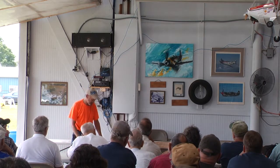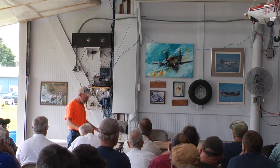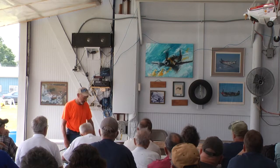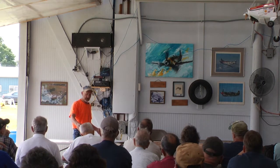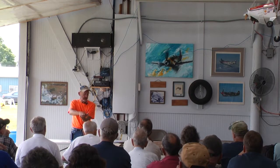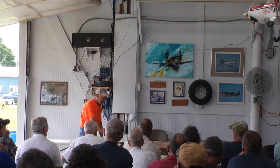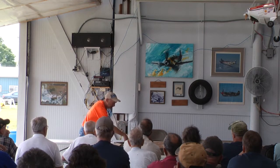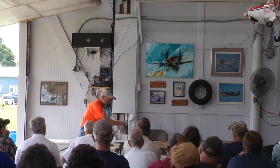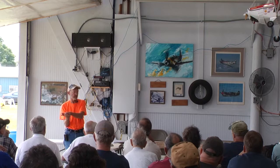So I had my five pieces pre-balanced, and I alternated the heavy ends. I stacked them up evenly, and I anticipated that when I smeared the glue on and clamped it down, I wouldn't have any control over the pieces moving out of place. So on a portion of the block where I knew I wasn't going to have the blade, I drilled some dowel holes on each end, so that when I had it all glued up and started to clamp it, I could shove a wood dowel through there, and I would know that the laminations would not be shifting with the glue.